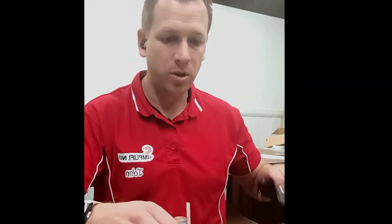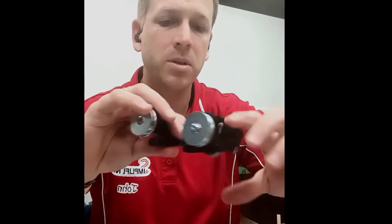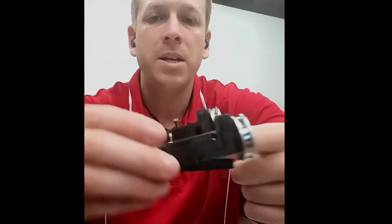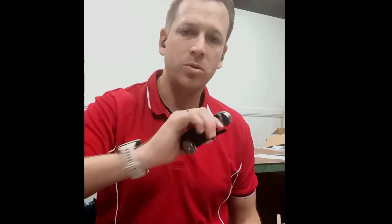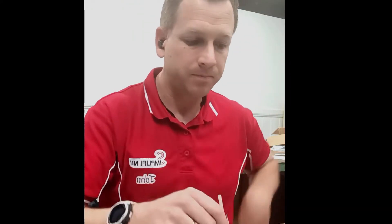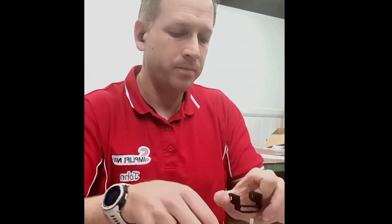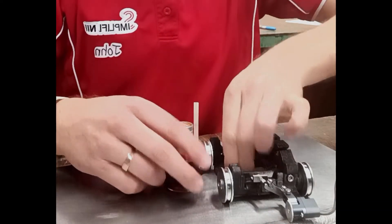You can also utilize this particular setup we've got in the crawlers — we're putting integrated irrigation into the crawlers and the palm scanners now. It sends water down into the yoke and comes out onto the work surface underneath, so in whatever direction you're scanning you get that low-pressure stream of water, soapy water, or whatever you're putting through the irrigation channel onto the work surface under the probe. In this instance we've got the irrigation integrated into the collar and we've also got these mounts which fit on here very nicely.